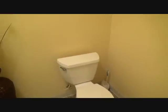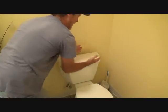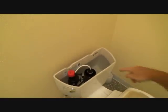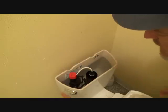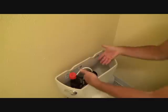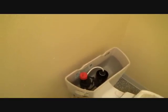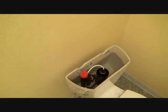You may think, why is it only 1.6 gallons? This looks like a tank that holds more than 1.6 gallons — the tank still looks kind of big. Well, let me get you in here a little bit closer. See this round deal in the middle? This lifts up when I flush the toilet. Let me show you how far the water actually goes down. See? That's all the water — from there to there — every flush. That's 1.6 gallons. This black thing lifted up and only allowed enough water to suck into the outlet, and that creates the actual pressure and flush to make 1.6 gallons possible. That's pretty slick, because lots of toilets don't have this round ring in there — that's the added beauty of this Kohler toilet.